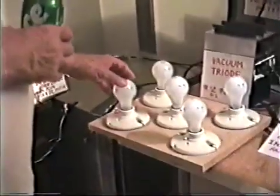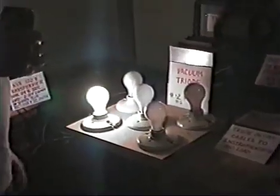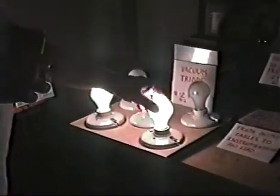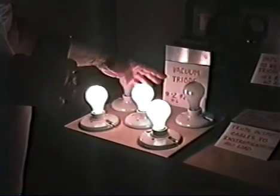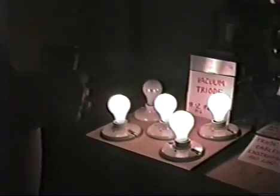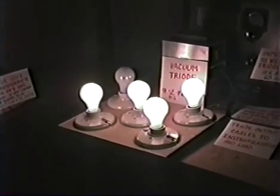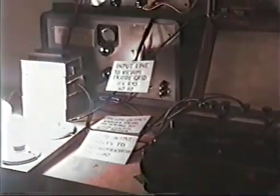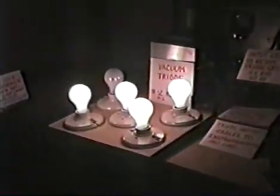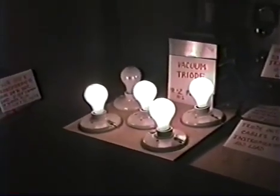We'll now energize the main lamps simply by connecting them into the load, screwing them in. There's the first 100 watt bulb which goes in. Here's another one. And here's another one. And here's another one. So we've kept the AC motor going. We've kept the DC motor and the DC lamps lit. We have 4 100 watt bulbs now being powered, and when I come off of this you can see they are brilliantly powered. When the camera is on the bulbs, the CCD steps the lens down so that we can actually get a picture. So we're producing now well over 400 watts.